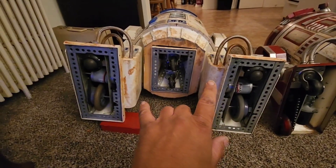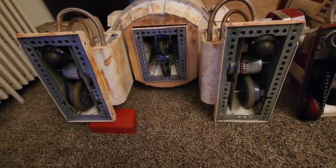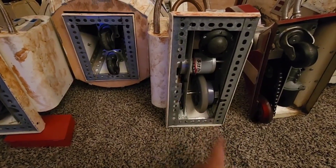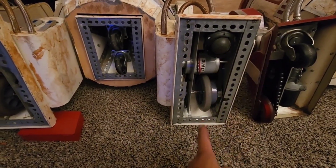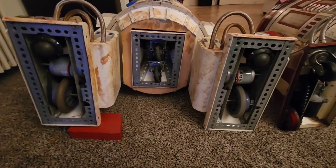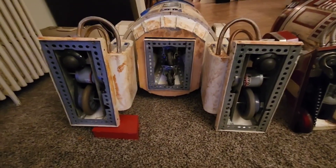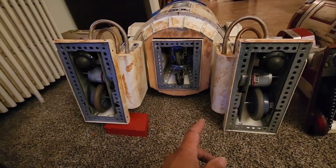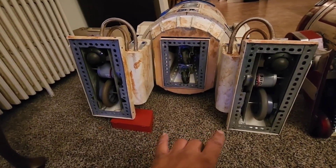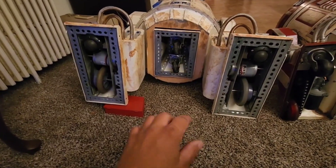This is where I messed up. My droids do a two- to three-legged conversion and back again. In two-legged mode, R2 has to be very stable — meaning where the wheels touch the floor you've got to have a wide stance. I do actually drive them around in two-legged mode, which a lot of guys in the club say you don't dare do. But it's a neat effect — R2 goes from three-legged to two-legged mode, stands there looking around, rotates to look at someone, and I'll feather the joystick right-left-right-left and R2 will do that little waddle-scoot thing towards somebody. It's a great effect.